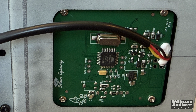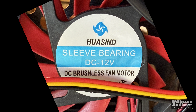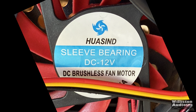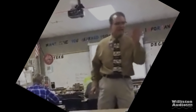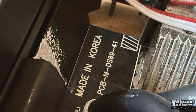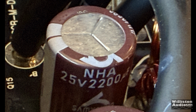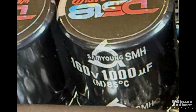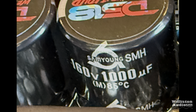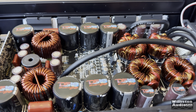We also have the back of the VM1 voltmeter and a fan sleeve bearing — DC 12 volts — and ball bearing people rejoice, because this is brushless. This is not a Mickey Mouse product, and this amplifier is made in Korea. That's why the price is a little bit more than some of the 3K amps you may have seen. 25-volt, 2200-microfarad caps on the power supply; 160-volt, 1000-microfarad caps, and these are from Nichicon. Overall, very beefy for a 3000-watt amp and looks very good.